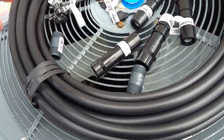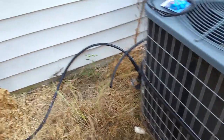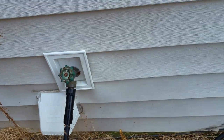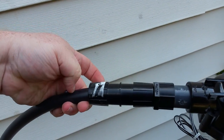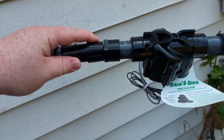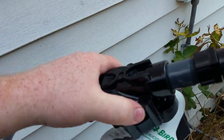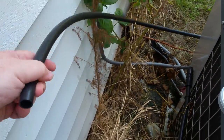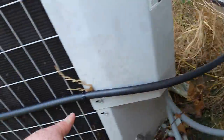This end piece is like a plug — it just plugs off the end of the tubing. You use these little tools to poke a hole into the pipe, and then these misters just fit into that hole. Let me mock it up quick so you can see what it looks like. So here's where I'm at so far. The filter will go between here once I get it. This is what the setup on the valve looks like: pipe to three-quarter female connector, three-quarter pipe nipple, three-quarter valve, another pipe nipple, and then another three-quarter adapter to pipe.